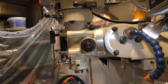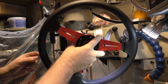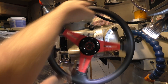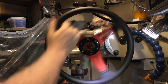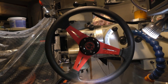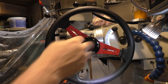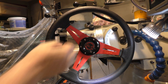Let's take a look at the Tangent Engineering solution. They made a nice wheel here. It has three pins, so it engages in three spots simultaneously — a very good idea. And it's not really sided, so you can just keep grabbing and going round and round. It does have three arms rather than four, but it has this wonderfully spongy, soft steering wheel rubber to grab onto. It uses a piece of all-thread with the end turned down to a point to engage the same grooves on the quill mount that the ball bearing on the standard handle engages. They've Loctited it with a wing nut on the end so you can pop it off.